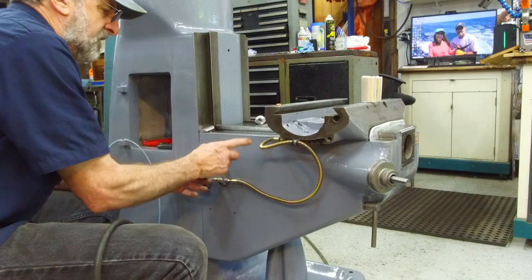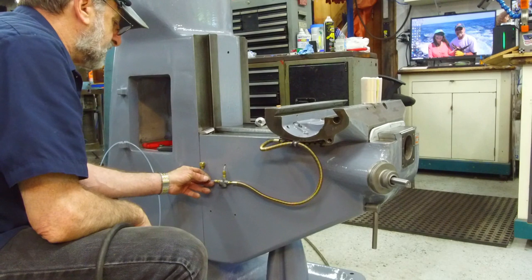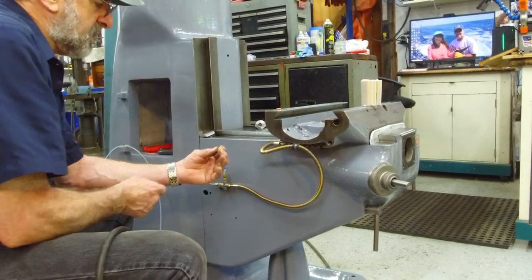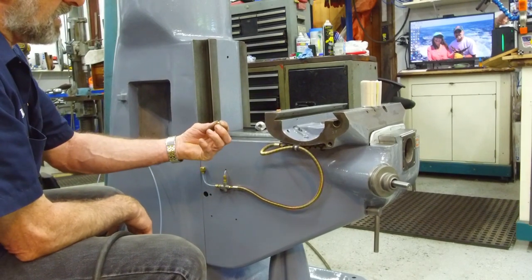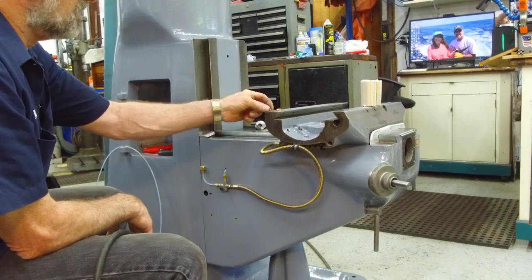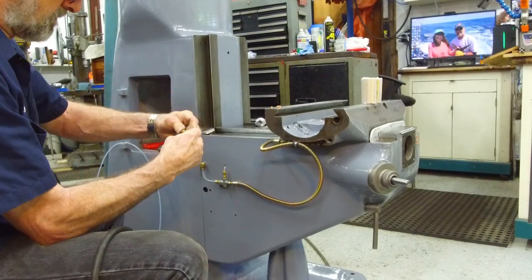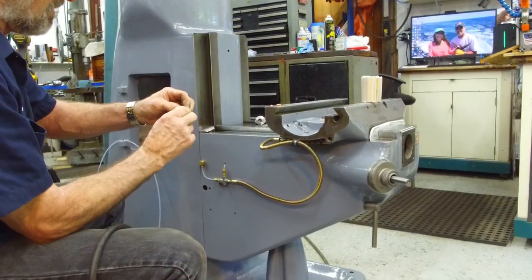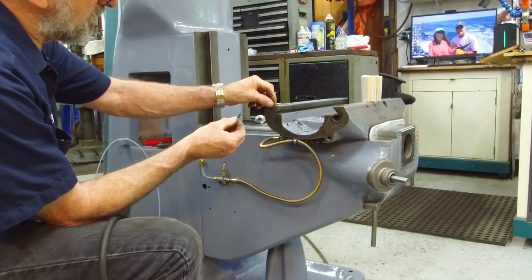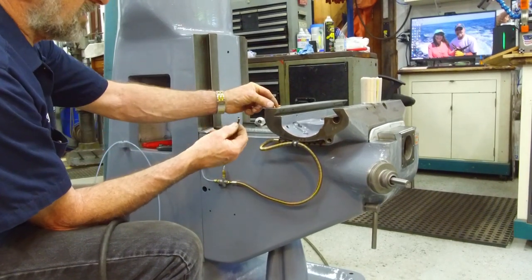The normal line for the Bridgeports is about 156 thousandths or something on the diameter. We're using 1/8, and we're making these quarter inch OD diameter, 1/8 ID, with a slight little angle, just like the original design of ferrules. Let me get this out of here. There we go. Same original design, a ferrule, flat on the nut side and tapered in.